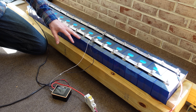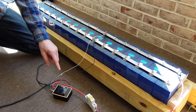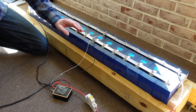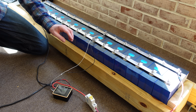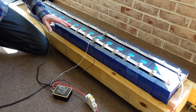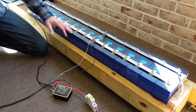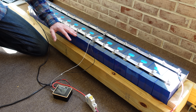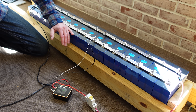The plan is to continue charging these — it's going to take several days for this to top balance properly. Once this charger shuts off, I'll restart it several times because the discharge curve of lithium iron phosphate, once it hits 3.65 volts, tends to drop a little bit. You'll want to hold it at that higher voltage because that's what allows the cells to balance out to the same state of charge. The idea is to keep charging up to 3.65 volts and allow it to balance until it rests somewhere around 3.5 to 3.55 volts.